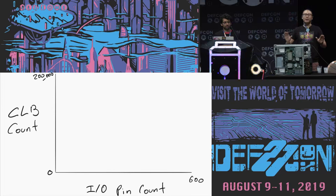And if you did that 100% correctly, again, without knowing any of the rules about how those bits are actually used for that FPGA, then you might have a hope of taking the bitstream that we found in the FPGA that we think is implementing the trust anchor, and altering its behavior in a way that might allow us to bypass the trust anchor capability. But the chances of people doing this on anything but a very simple FPGA are very low. In fact, I'm not aware of anyone who has successfully done that entire path on a real-world commercial application of an FPGA with a commercial bitstream. So chances of that working are very low.